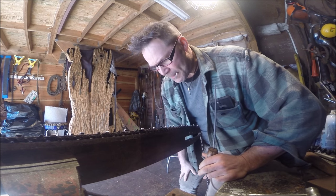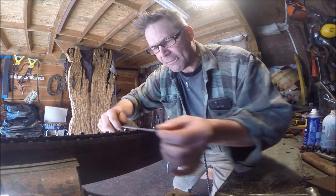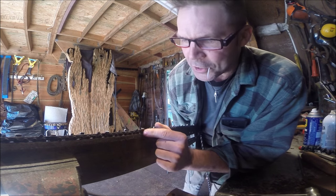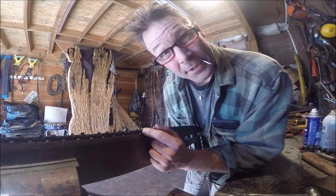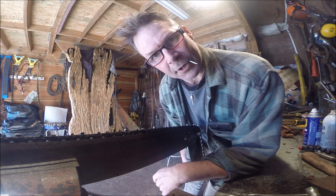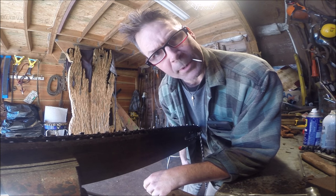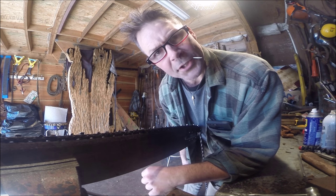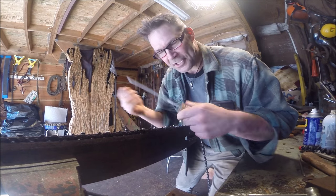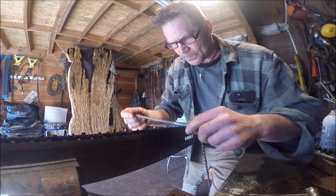I know there's a few other fellas that run the guides, and that's great if that's what you want to do. Now, this gives you kind of an idea. I always talk about getting the gullet — you've got to get this gullet out. If your teeth shank back like that, it's no good. You'll cut and if you don't know any different, it won't make a difference to you. Anyhow, I'm dealing with a ripping chain right now that's about 30 feet long.